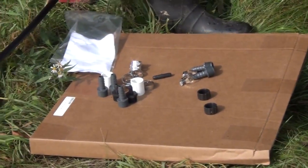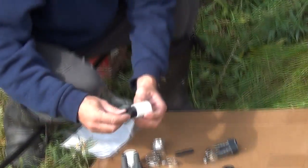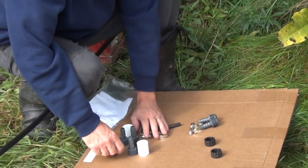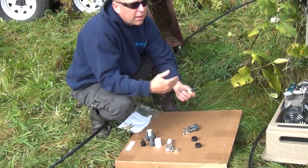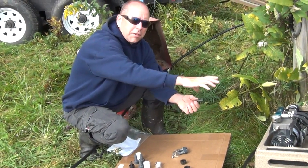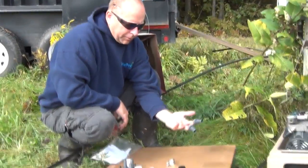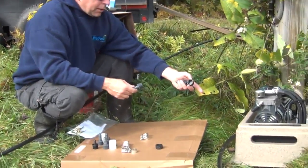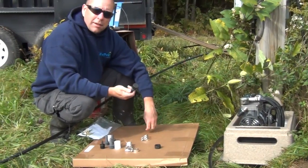Now we're down to hooking up the compressor — got a bag of goodies. This is the setup for going from 5/8" direct bury to the 3/8" self-weighted tubing. We have plenty of hose clamps, a connector for the 3/8" self-weighted tubing in case you have one piece that's 150 feet long and need to cut another 100-footer — making one 150 feet and the other 50. We also have two more 5/8" adapters and end plugs. So if you want to take this up out of the ground or take it in for the winter, you just screw the caps on and nothing can get in to plug up the lines.